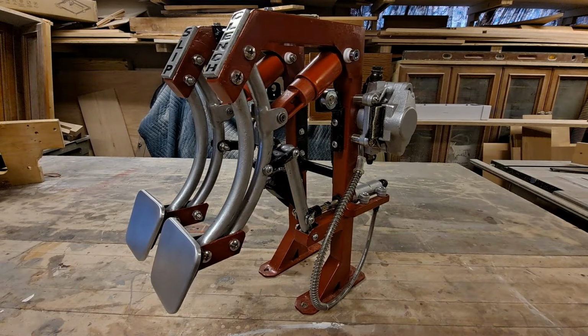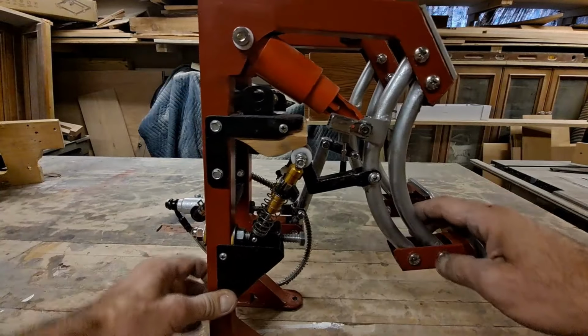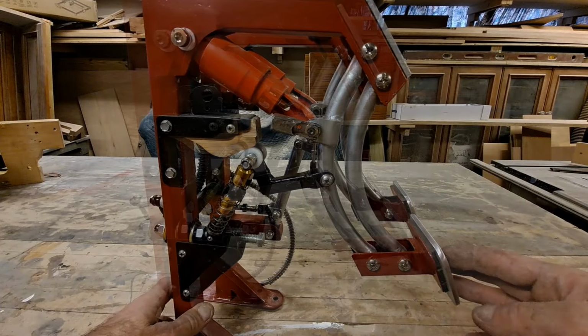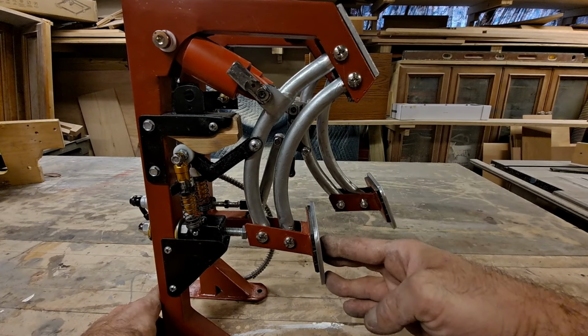And now it's time for the fraternal twin brothers. We got slip and clench. Now, we're going to talk about slip first. You can see that I have a whole lot going on here. I have a double parallel arm system here. The reason for that is the angle face is about 65 degrees in the Z when it's full out. When you push it all in, it goes down to about 10 degrees, something like that.